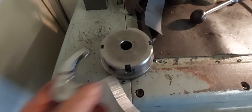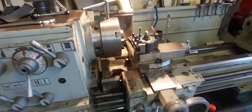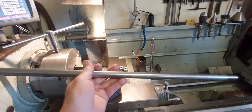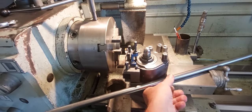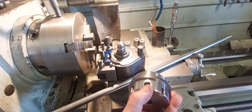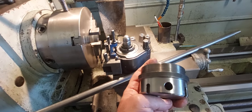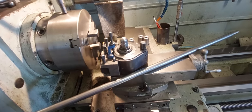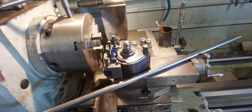You just use the C-spanner — available from most industrial suppliers. I can't show you on the back of the machine because I haven't got enough room to get in there with the camera. So the next part of the puzzle is this long big bar. The hole through the center obviously suits this size bar. It's got a grub screw that runs down inside — so it's bored down so far, then there's a thread in there with a set screw. You tighten it down on that bar to set how far you want the bar protruding through your chuck.